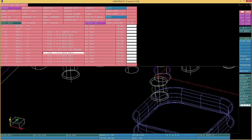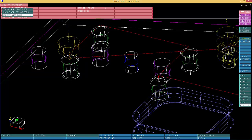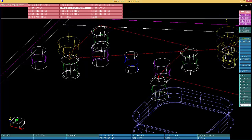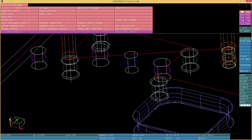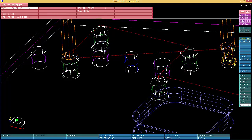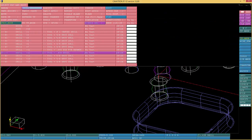You're gonna go and choose that and go over here, Model 5, and then Machine Parameter Tools, New, Select Tool, .438. There it is. And we're gonna go deep hole, and whatever, it doesn't matter here. Tip, and you're gonna go .750 just for clearance. Go all the way through, and machine parameter 1600. You wanna go 9 inches. The other one is 3.1, which you can go 9. It's up to you, how fast you want to go. And that is that.